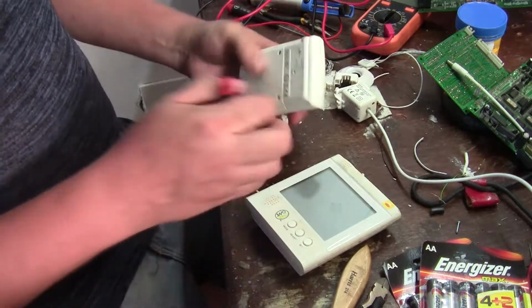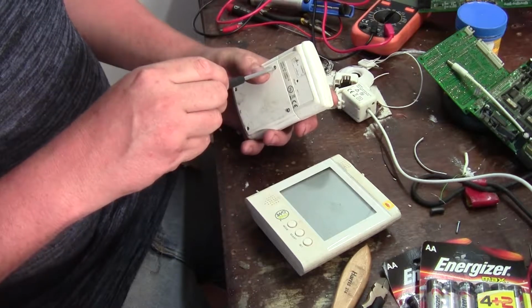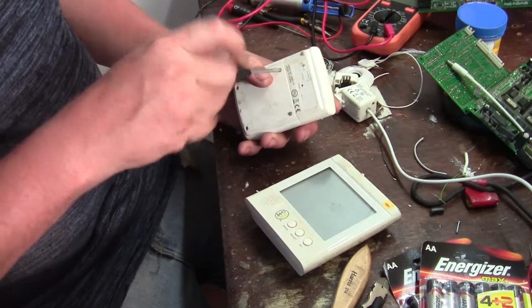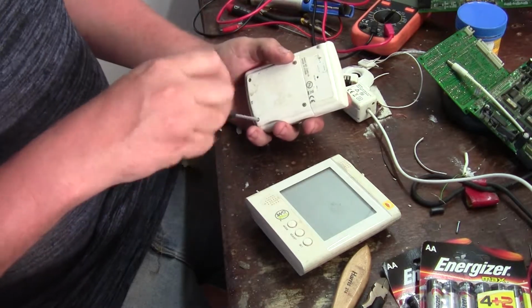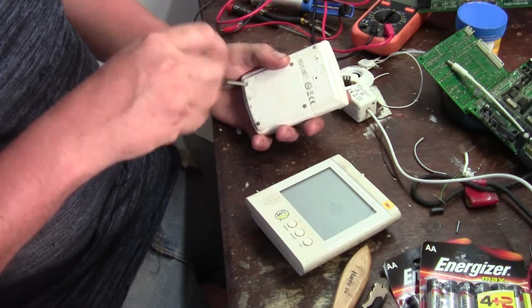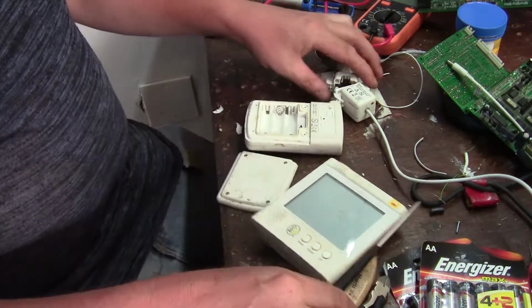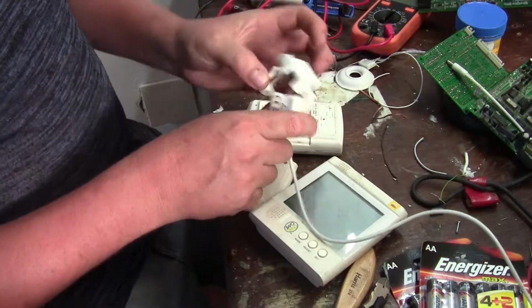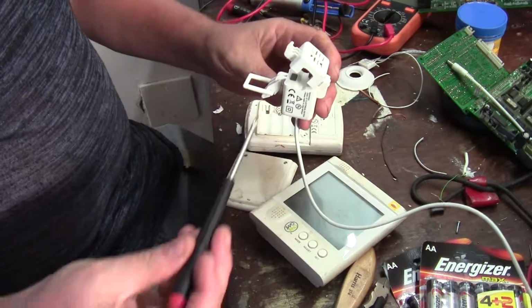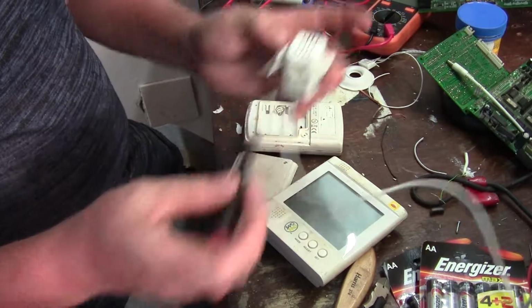Okay, so let's go. Firstly, got to put batteries in, because the safest way of doing this current monitoring is not picking up power from the DB. So I just got batteries for the transmitter, batteries for the receiver. Current transformer clips non-invasively. Say this is the live wire in your DB. This goes in there, clip, latches, and there we go.